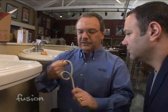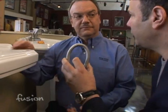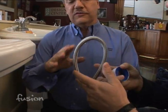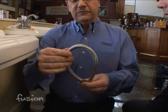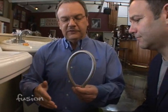You're replacing the faucet. And these are great because they are a no burst, meaning that you can flex them, twist them, they won't break, and they're pretty much impervious to everything. Now, sometimes these show, especially on a pedestal sink. So you can get different styles. You get these in brass, you can get them in chrome, and they're also solid types, again, which you can bend with a tubing bender, a little more technical, but these are the easy ones to do.